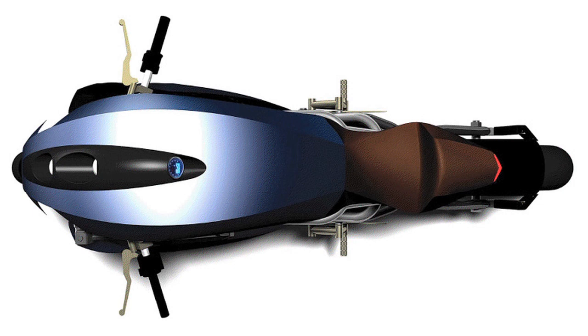The flexibility of having an all-electric urban sports bike means we can manage where we put that mass much more flexibly. If you have a four-cylinder engine and a gearbox, there's only certain places you can put that — it's going to have exhaust coming out of it, the inlet trumpets can't be behind your backside. It's got to be a certain layout. Whereas with our cell system, which is also our structure — our battery pack is our structure — we are able to put the mass exactly where we want it and manage the polar moment of inertia of the whole bike as effectively as possible.